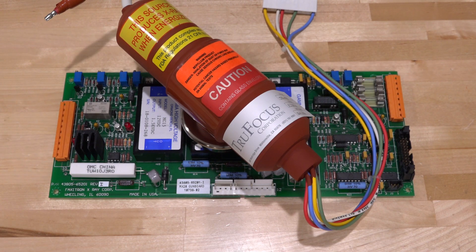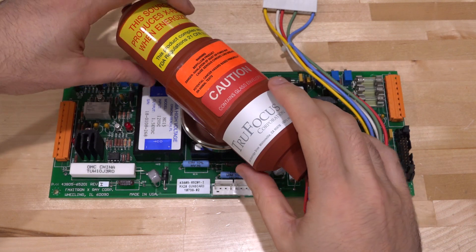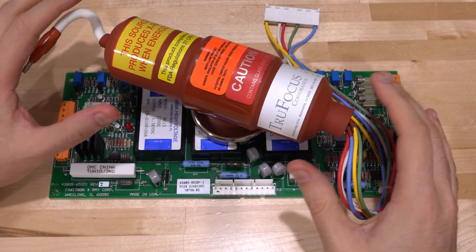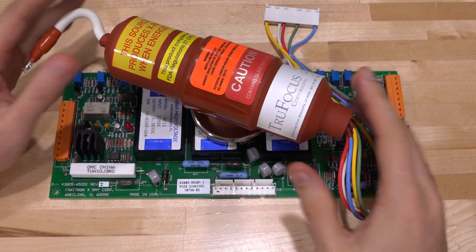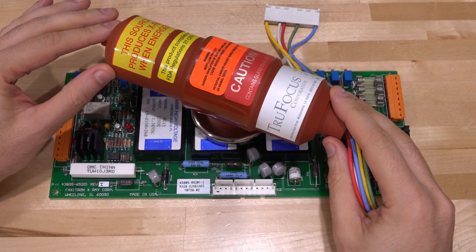A few necessary points of warning: this tube absolutely should not be energized outside of the x-ray machine without the machine having complete enclosure, even if you're almost sure that it is broken. Energizing this with a high voltage power supply will create x-ray, and the x-ray will not just come out of this port — it will come out of other places around it. It has to be enclosed appropriately with a thick enough metal depending on the energy of the x-ray. So I would never power it outside. I already know it is broken, so we're not going to play around with it beyond opening it. And of course, with the glass and the beryllium and everything else, you're going to have to be very, very careful.